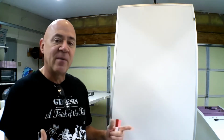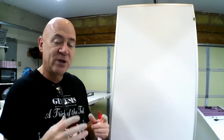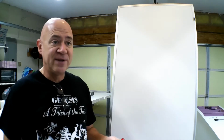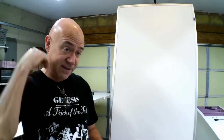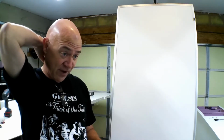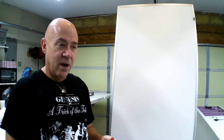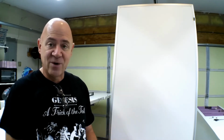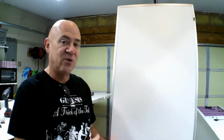There's certain things you need to think about in your airplane: how fast is your airplane, what's your targeted speed you want your plane to fly at? So if you know what your cubed wing loading is and you have flown model airplanes and stuck a GPS in the airplane, you're going to find out that most of our airplanes fly pretty comfortably between 25 and 50 miles an hour, unless it's a warbird. Some warbirds literally flat out can go 100, 150 miles an hour at full throttle. Well, that's not the minimum power or the targeted cruise speed. That's somebody trying to do a speed run.